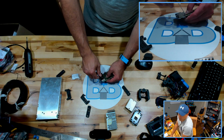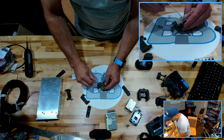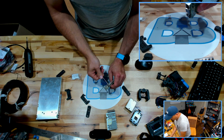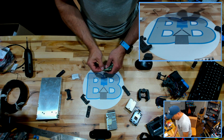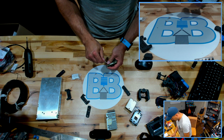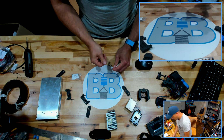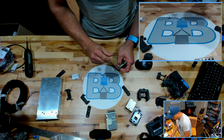Raspberry Pi itself doesn't really use that much power. I think it's under 3 amps if I recall correctly. So you could definitely get away with using probably what's on that Spider board. But again, the kit came with the Meanwell, so I'm going to go out on a limb and figure that that dedicated power supply is going to be a little bit more robust, probably have a little bit cleaner power out of it, less ripple, those types of things. So we'll use that.